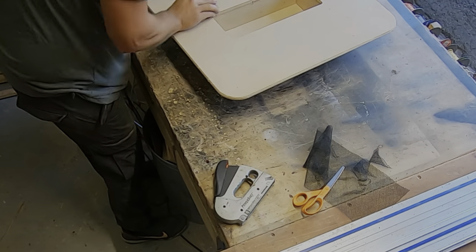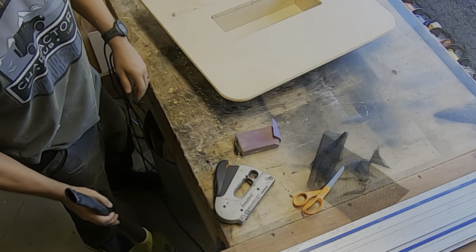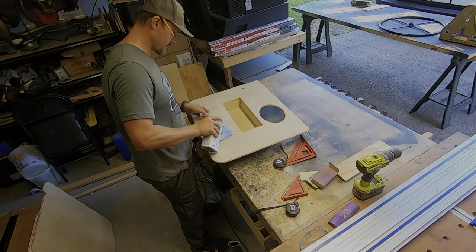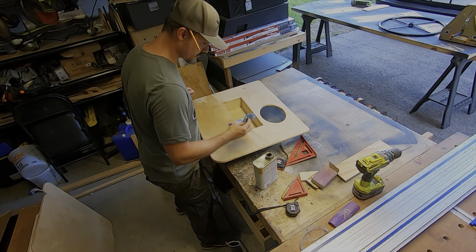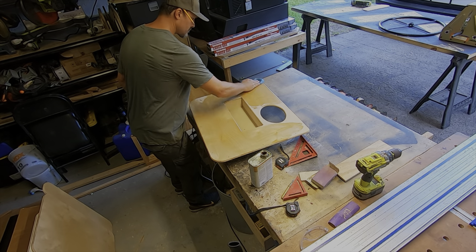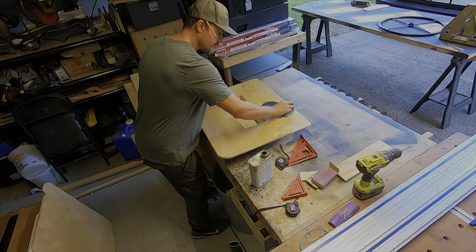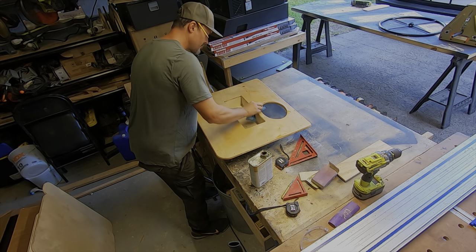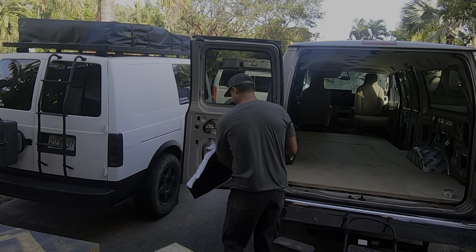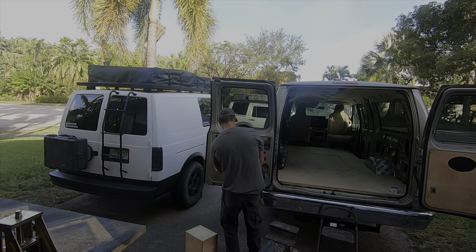Now that I've finished sanding, I'm going to go ahead and clean everything up, spray it off with my leaf blower, dust it with a rag, and then break out the tung oil which is what I use to treat the plywood. I'll do two to three coats about an hour apart, front and back, and that will give it a nice natural look and also protect the wood when it's on the door — because the doors will get wet in the rain so you have to protect it pretty well. Next I'll put insulation in the inside of the door, which will be behind the door panel, so the door is insulated.